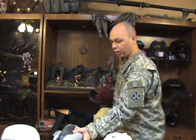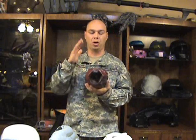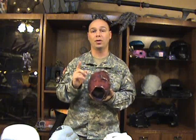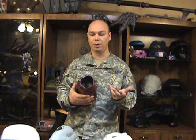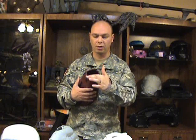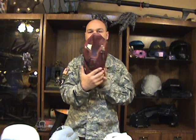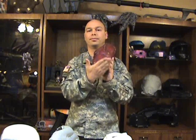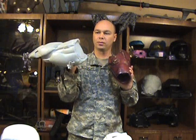With Adam's gauntlet here, let's just say you want to do this gauntlet. That is primarily what the question was about, how to mold the gauntlet. The first thing you're going to do is take a piece of any type of flat, hard surface that will not bleed through, and you're going to create a closing point right here. Why on this end? Because it's flat, unlike this end, which is not flat. Tracking? Good. Block off the bottom, similar to that. So that's blocked off.